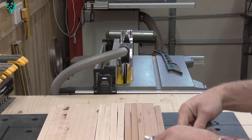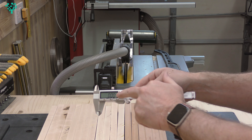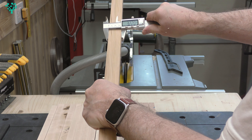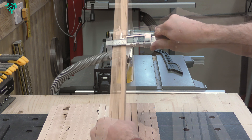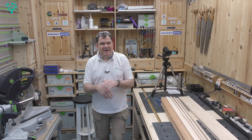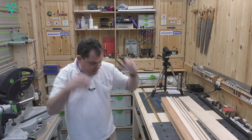In terms of size we were heading for around about 32mm. Checking with the calipers: 32.2, 32.28, 32.29, 32.16, 32.4, 32.4 — so everything's got 32 in the number at least. We set it for 32 on the calibrated gauge and went for it, so coming out between 32.1 and 32.4 is not bad — 0.4mm tolerance out of the box. I can live with that.